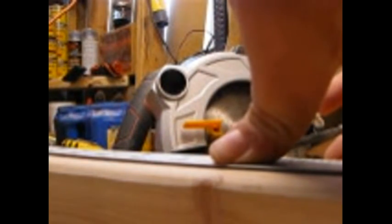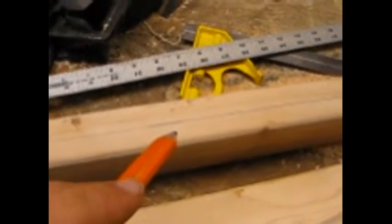You're going to want to do this on both sides, because you're going to be using 2 different saws to split this. So first you draw your line. Try not to let your straight edge move like I just did. First you draw your line, which breaks the center of the 2x4, and there, I don't know how well you can see it, but there is the line to break the board with. And then all you got to do is just rip it out.